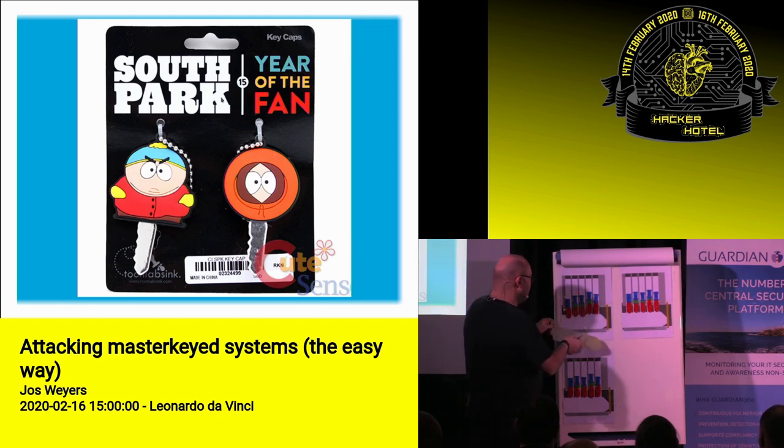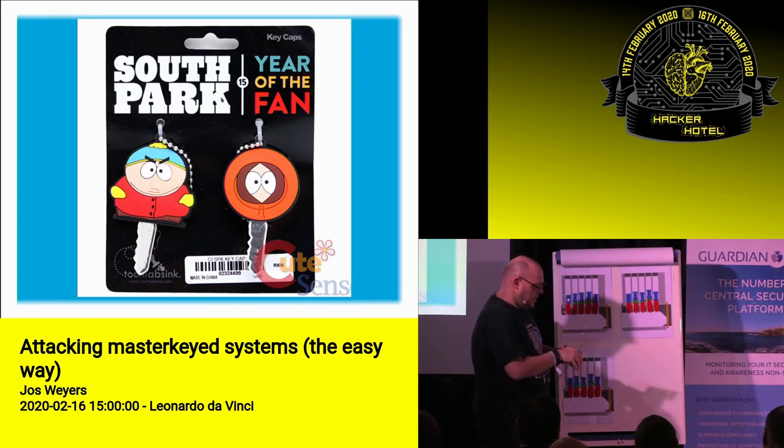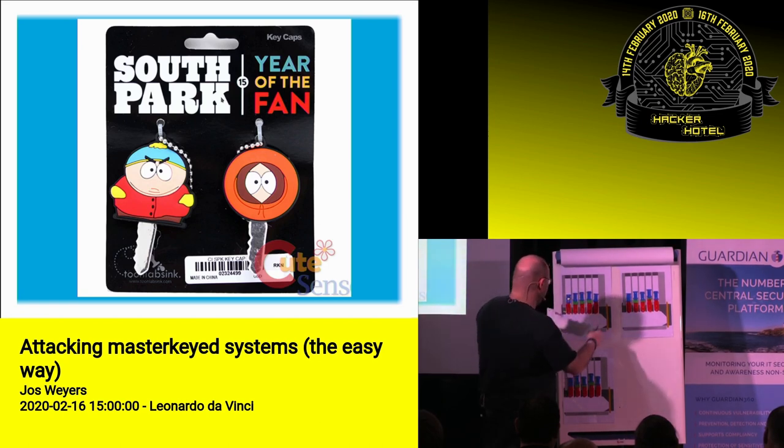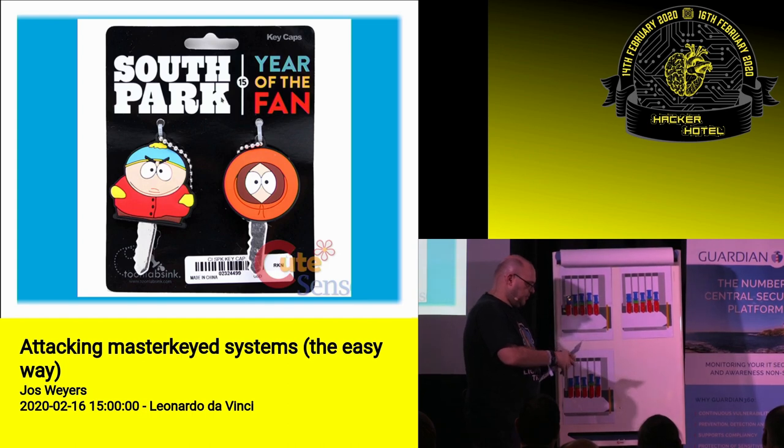And then rinse and repeat. But if I start off with a blank key and I impression this, this will mark, that will mark, that will mark, that will mark. They all mark the first time. So I speed up a bit, because of course that would be one or two pins at the same time. Boom. Boom, boom, no, that's within the lines. No, still not there. So, impression a bit more. It's quite a bit faster this way than actually filing.